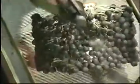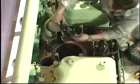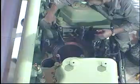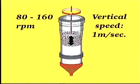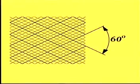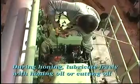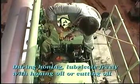Lubricate the honing tool and the liner with honing oil or cutting oil. Adjust the speed of rotation to 80 to 160 RPM. Use a vertical speed of about 1 meter per second to achieve the required angle between the honing grooves. During honing, lubricate freely with honing oil or cutting oil.